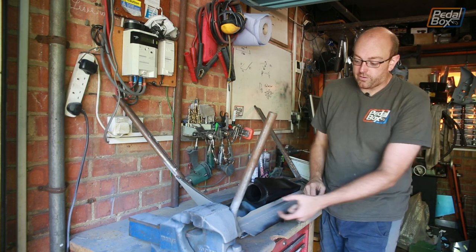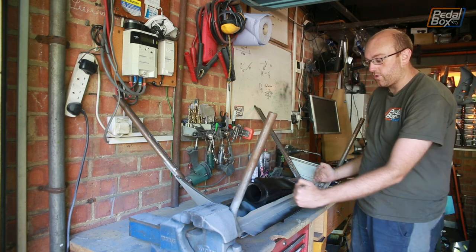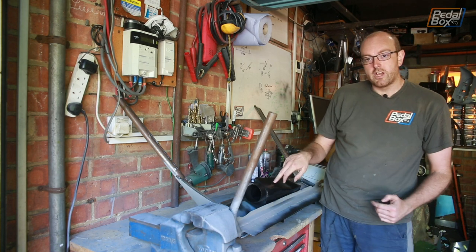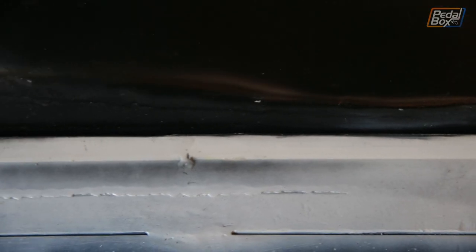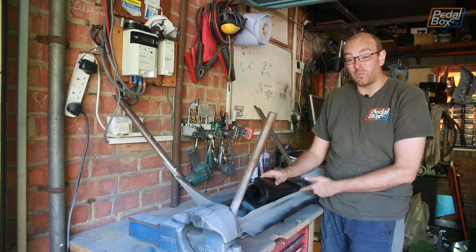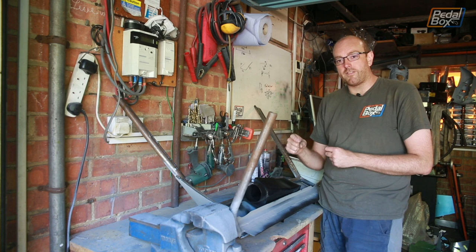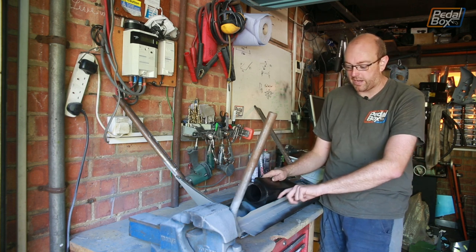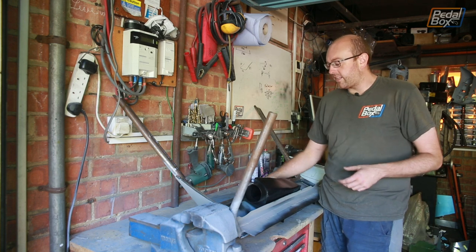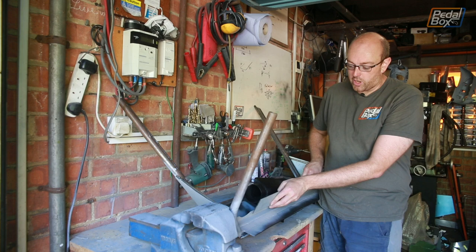It comes up and then you've got the main roll cage tube across here, which is why this had to be pushed so far out and so close to the back panel of the, or in fact the front panel of the air collector. And that gave us a problem because we can't just pop rivet straight through this. I mean, we could if we got close enough, but it's not going to give you a very deep pop rivet and it's probably not going to hold where it's less than an eighth of an inch just across the back of here. So we're going to extend this down to make our lives a little bit easier and add this plate onto the top.